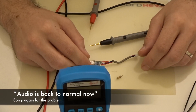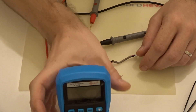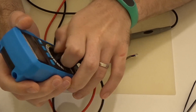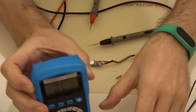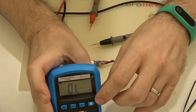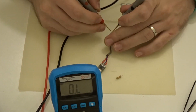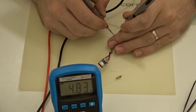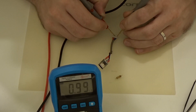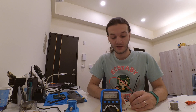Now we're going to measure the resistance between the ID pin and the ground, just to double-check that we have a good connection. We're looking to see if we can get the 10 kilo-ohm value on the multimeter. We measure between the ground and the ID pin cable — and yes, that's the 10 kilo-ohm value right there.